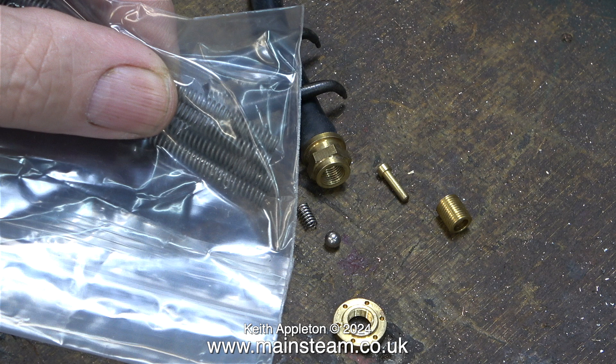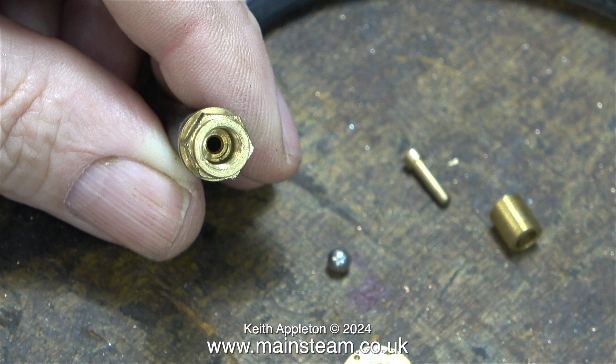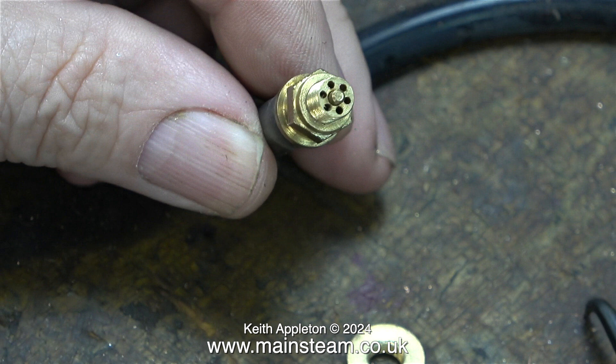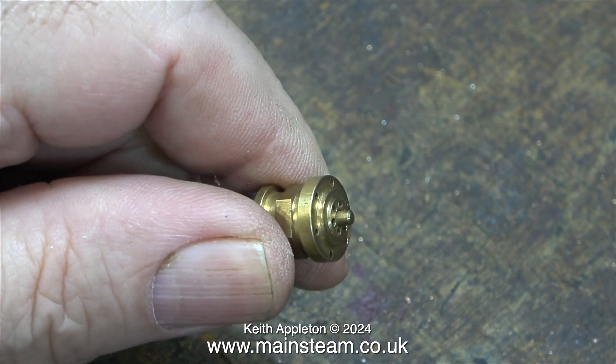Anticipating a change in the spring, I bought a pack of stainless steel springs from Black Gates Engineering, but these are actually too big. The original spring that came with the safety valve is perfect. This clip shows the seat for the stainless steel ball down inside the valve. This is a very small safety valve — it only has a 1/4 by 40 threads-per-inch thread that goes into the boiler. My normal circlip pliers only just fit. You can see the principle: you adjust the internal part and then tighten the locking ring.